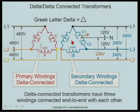This transformer is designed primarily for industrial applications in warehouses where most of your loads are going to be single-phase 240 volts or three-phase 240 volts, and you have very little 120-volt loads. By going to a delta-delta system like this, you're able to raise up the voltage and drop down the size of your service. That's one of the advantages to a delta-delta configuration.